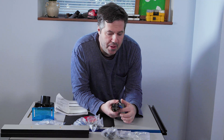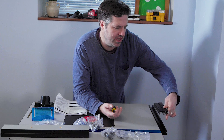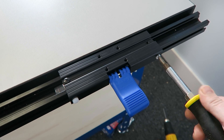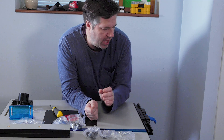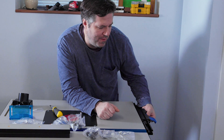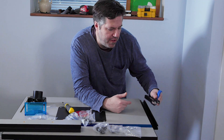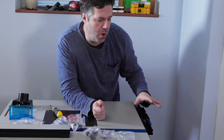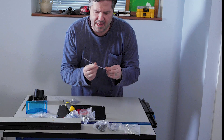The next thing is to put the block adjustment on. This slides over and then we adjust the little nylon screws on the side so they just touch the metal — this allows it to glide back and forth without wobbling. Those nylon nuts keep it from wobbling side to side, but they don't prevent you from lifting the plate off completely. Once you unlock it you can remove the fence bracket entirely and put it back to lock it in place.